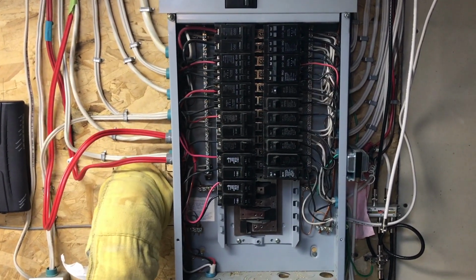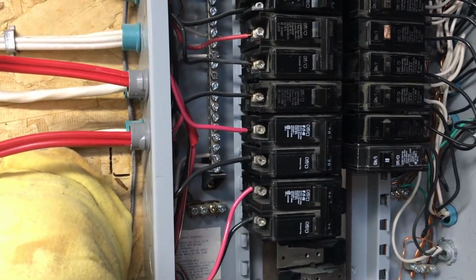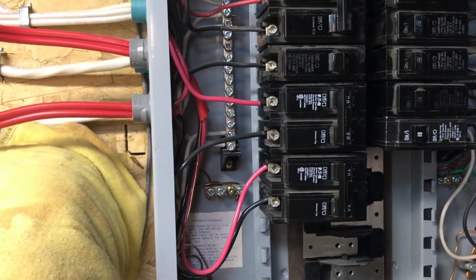So how do you wire it? With 240 volt, there aren't a positive and negative side. They're essentially both hot sides. First, I wired the receptacles into the wall and then did the breaker install last.